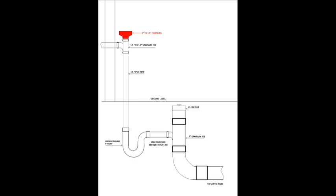Next I used a 3-inch to 1.5-inch reducer coupling to go from the 3-inch pipe down to the 1.5-inch pipe. I needed a splash guard so I don't pee on the wall. I used my bandsaw to cut a piece of 3-inch PVC drain pipe to an angle of 45 degrees on one end. Then I cut it down so it was a total of 6 inches long from the pointed top to the flat bottom.